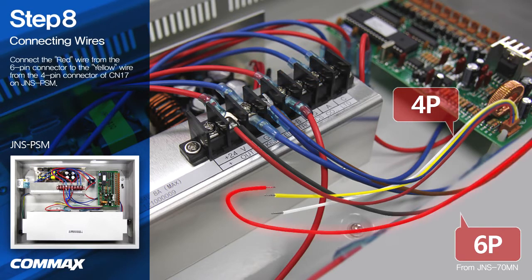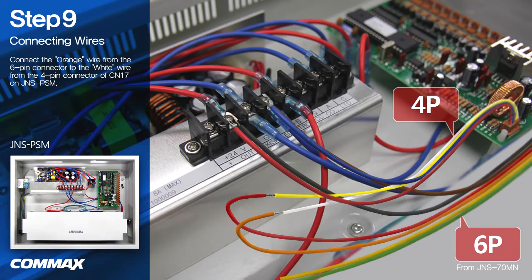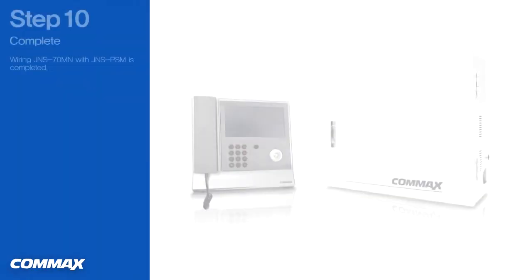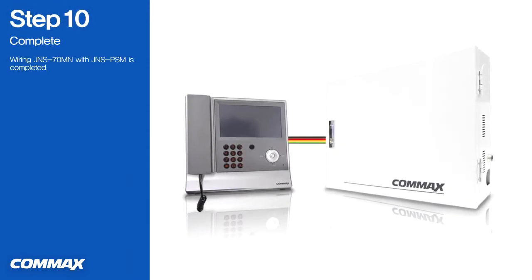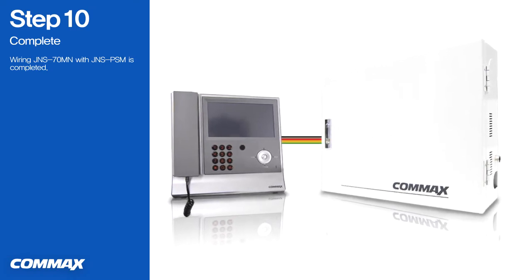Please connect the red wire from the 6-pin connector to the yellow wire from the 4-pin connector of CN17 on JNS PSM. Please connect the orange wire from the 6-pin connector to the white wire from the 4-pin connector of CN17 on JNS PSM. Now, wiring a nurse call station JNS 70MN with the main panel JNS PSM is completed as shown in the above.